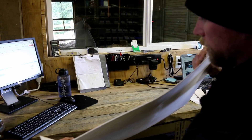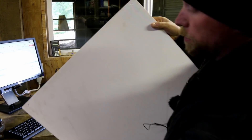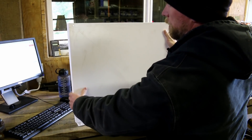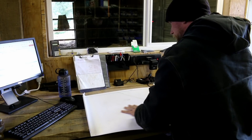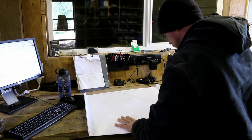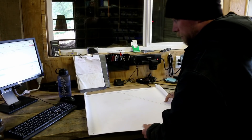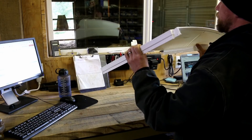Not that I'm an expert but I'm learning quickly — I think this nozzle size I chose, the one millimeter nozzle size, is simply too large for the accuracy that I need. So we need to drop it back down, and if we drop it down then I think this layer height will probably be fine. But the fact that it didn't adhere is problematic. A change of the nozzle down to 0.8mm and then re-leveling the bed is what we need to do, and then get another print going.